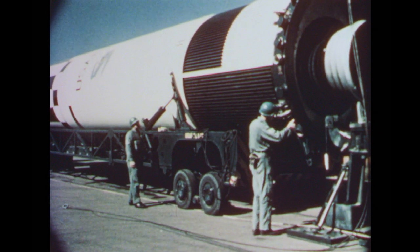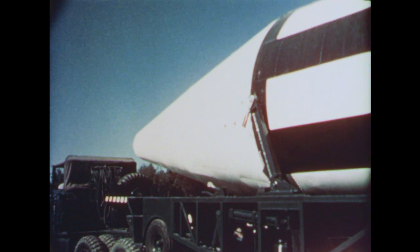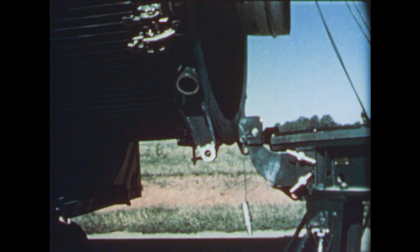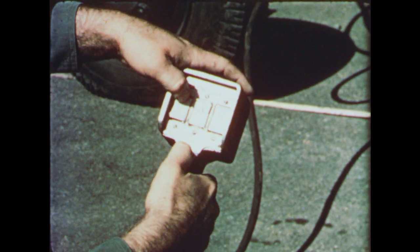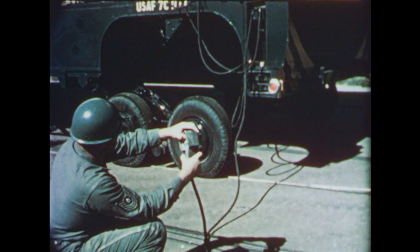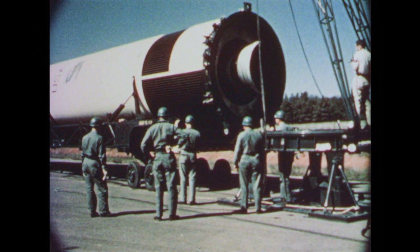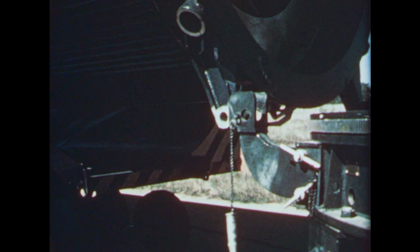After the actuation of the hydraulic lever, the missile can be raised or lowered by a portable switch which pivots the arms. The last few inches of travel are the most critical. Up-down movement is controlled by the portable switch. The portable switch operator can assume a vantage point close to the launching ring at an angle that gives the best view. Close coordination is essential now between three crew members.